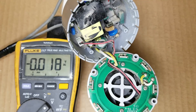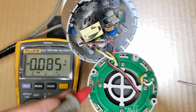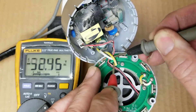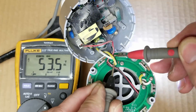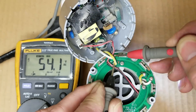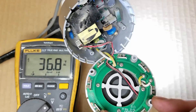So what I'm going to do is try to power it up here and measure some voltages and see what's going on. I'm going to plug it in and you can see it flashing. Let's try to measure the voltage coming out of the power supply. It's going up to just over 50 volts on the peak, coming back down into the 30s. Let's put it on min-max — 53.5 volts, 53.8 is the highest voltage, 54. I'm still getting voltage at the non-working LEDs.